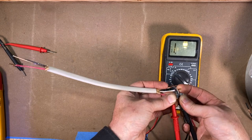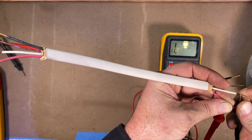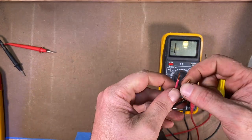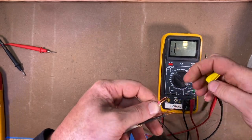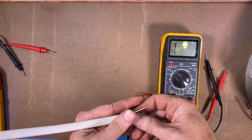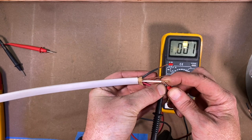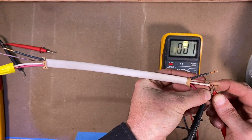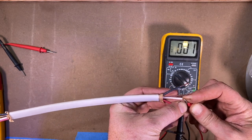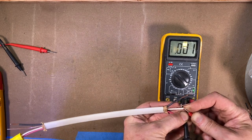You're not reading any ohms or hearing the buzzer. So down on the other end of this wire, say you're at the electrical box — put a wire nut on this end, and now you're going to get a reading and an audible tone. That's a great way of tracing wires in a wall. Sometimes you can set this up on a wire while working by yourself, go down to the other box, start tying wires together, and when you hear the tone, you've struck gold.